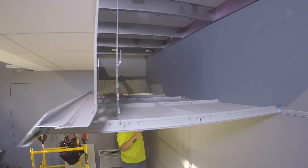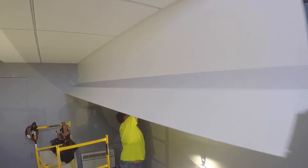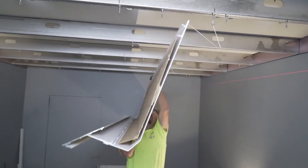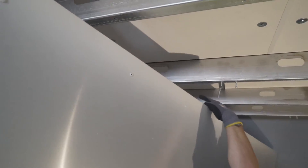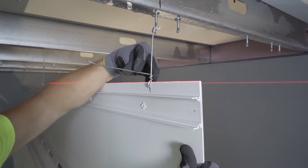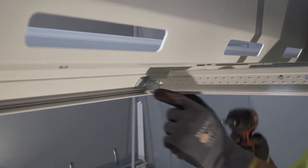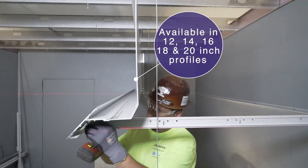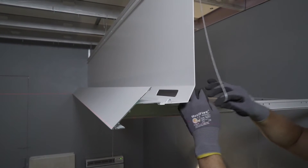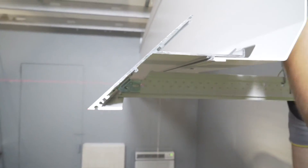Let's look at the Axiom ceiling-to-ceiling light cove with bold vertical heights ranging from 12 to 20 inches between ceiling planes. Like the ceiling-to-wall cove, we want to first hang each 10-foot section of cove with a balancing hanger wire in the middle, then additional wires on 4-foot centers along the top flange. To help plumb your cove, a piece of angle behind the vertical backsplash will help to center the cove vertically. This cove is available in 12, 14, 16, 18, and 20 inch vertical heights. Attachment of the lower grid system will bring the lower knife edge lighting extrusion level with your laser plane.